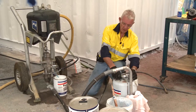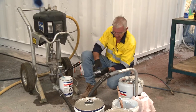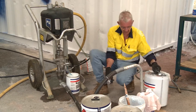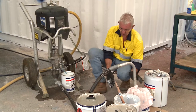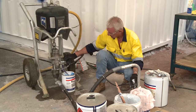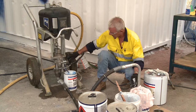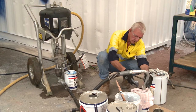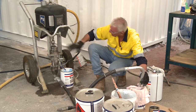That's a primary rinse. The gun still has pressure in it — I can evacuate the pressure by putting the gun in a container and pulling the trigger, or I can evacuate the pressure out of this tap here, just like that. It pays to put a piece of rag over it in case it splashes back at you. With that valve open, I can take the safety off the gun and pull the trigger — happy days, no pressure. I've released the pressure from this hydraulic pump with no air over the air motor.